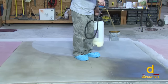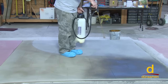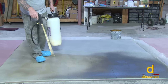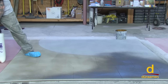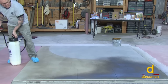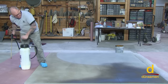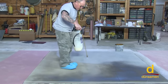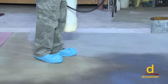Another reason on some self-leveling overlay cements, if you went with just a straight epoxy, basically they're so dark and when the epoxy absorbs down into it, what happens is the epoxy right on the surface literally just darkens the surface so much. So one way to eliminate that from happening is to prime — in essence with the AO3 — like you see it's doing right here, and that's going to once it dries set the base color.